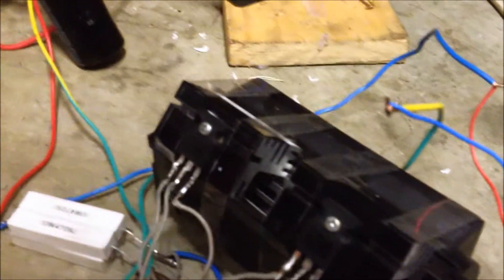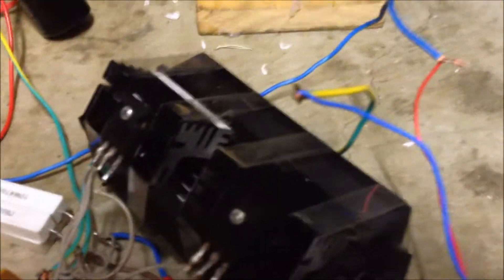I've made a few improvements to this. One YouTube video I watched, the creator added some modifications: adding this diode and this diode — not this cap, I just put that there experimenting — and this resistor. Those diodes have their negative sides each going separately, with the positive sides connected together like a little triangle, and then the negative sides going to the feedback wires, both of them.